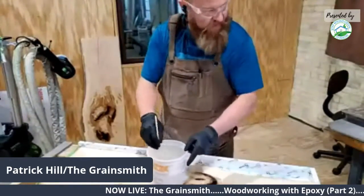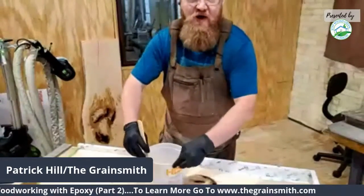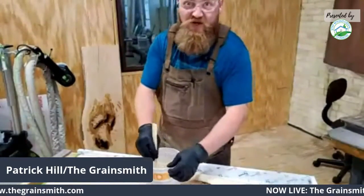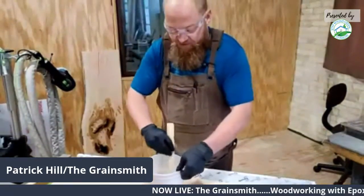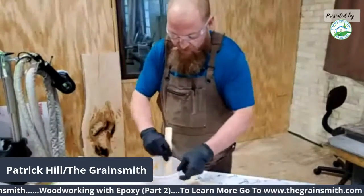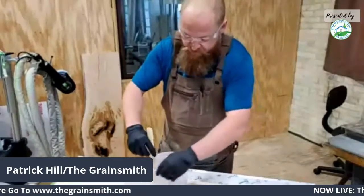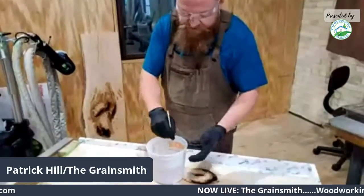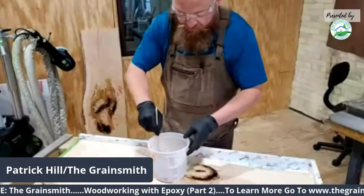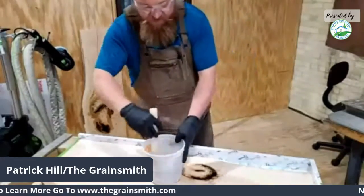That's definitely something. If you're holding a cup of epoxy and it starts warming up, start working on getting that spread out into your workpiece. If not, grab multiple cups and maybe disperse it into lesser volumes to help try to cool it off. When it starts heating up in your hand, that's a good sign that you've got a little too much volume. If it's a little bit warm, that's to be expected, but this is actually nice and cool yet. So that's one of the big benefits of these long cure, slow cure epoxies.